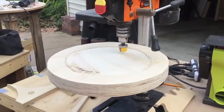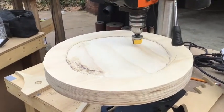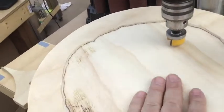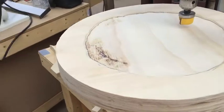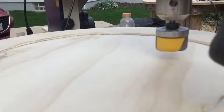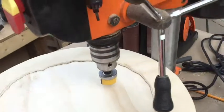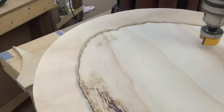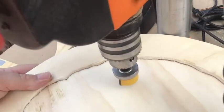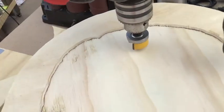I am finally getting around to bowling out the seats for my three-legged tri-stool bar stools. I'm supposed to dish out, bowl out the inside because our bottoms are not flat — our bottoms are round. So I tried this method: I bought a bit, like an inch bit, kind of like a bowl bottom, and I put it on my drill press to go down about a quarter of an inch. The flaw with this is it's not really secure, you really got to hold it, and it has possibilities of jumping. So it's probably not the best way to do it.